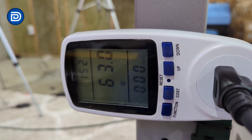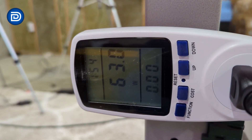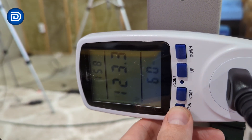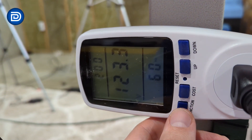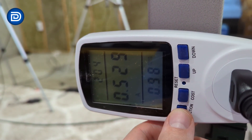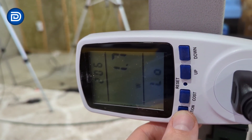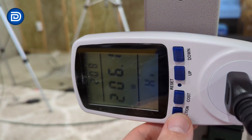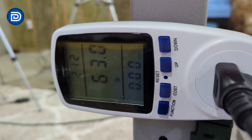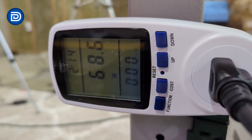At the power source, I put a meter on it so we could see what the power supply is consuming. Currently showing 63 watts, 123 volts, 0.52 amps. Our low is 1.7 watts and our high is 206 watts so far with just the initial boot up. Everything right now is just powered on with our test bench at idle.